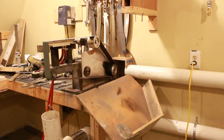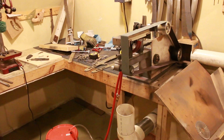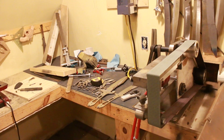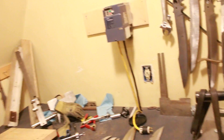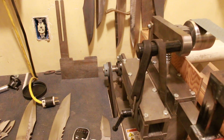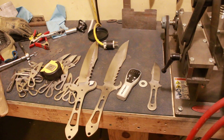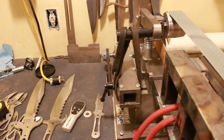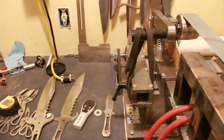I also ordered a couple of step pulleys from an electric motor warehouse that had Massic or some kind of weird name pulleys. They look the same — they're the same ones that KMG sells but less money because they're more of a specialty house. I bought step pulleys for this setup so I can get even more gear reduction or go faster, which will be nice with that slow-moving motor.